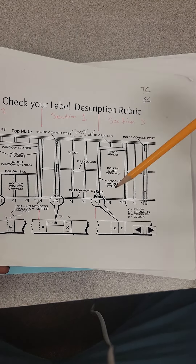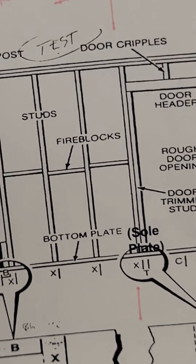Next is king stud. A king stud is a vertical structural element placed off-layout adjacent to the frame opening on each side, such as a door or window. It's the same length as the common studs in the wall and fastened in a similar manner. Because it's supporting the opening of the door, it became a king stud — it supports the jack and also supports the header. Its role changed depending on what it's doing at that point in time.